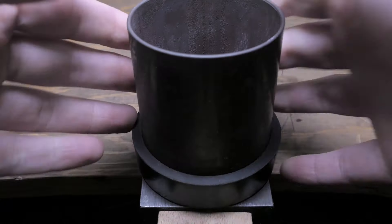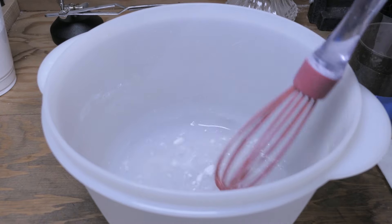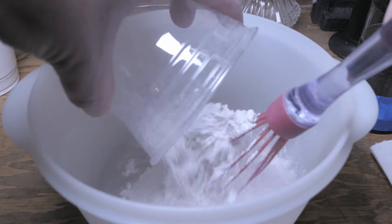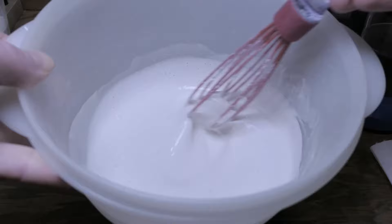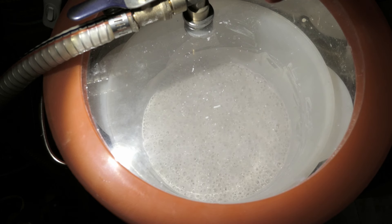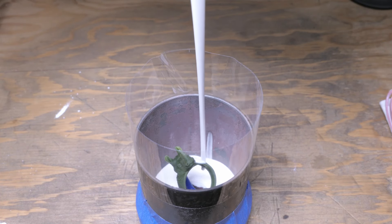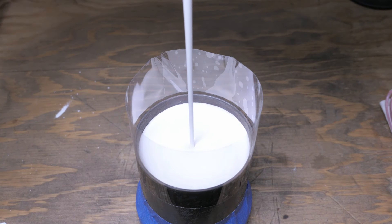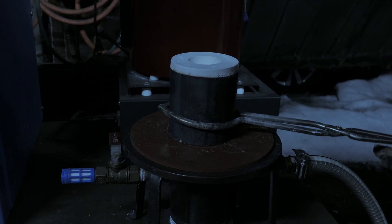For the investment, it would probably be better to use something like PlastiCast, which is better suited for resin-printed casting, but I don't have any at the moment. So I'm going to try to get away with using some regular SC20 investment by R&R, and I'm going to add 1% boric acid just to give it some strength. My hope is that these prints are wax-like enough that the resin can melt out of the mold and hopefully not expand too much during the burnout. I did an 8-hour burnout cycle in the kiln, ramping up to 1,350 degrees Fahrenheit and holding that for a few hours before bringing it down to 1,000 degrees for casting. That's probably a little too high for this size of ring, but it is currently freezing outside, so I figured I would lose a little bit of heat faster than normal.